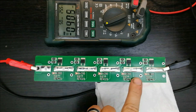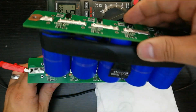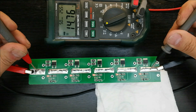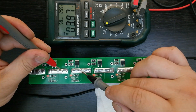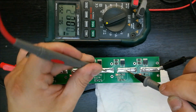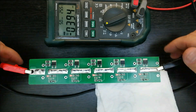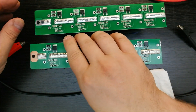There we go — fully soldered. I just have to clean all that flux off now, so I let it cool down. Now I've got the board all cleaned off, nice and pretty. I also put some tape on the back so we can hold it down. Let's check the voltages now that we've cleaned it up. We are at 14.76 volts total, and everything is protected. Individual cells are reading 2.945, 2.959, 2.949, 2.955, and 2.968 volts — not bad. They're all protected. Here we have a completed string, and of course the second I take them off they're done being protected. So now I have two of them made up and need to make three more.